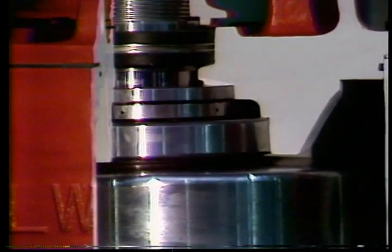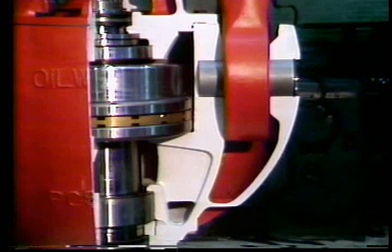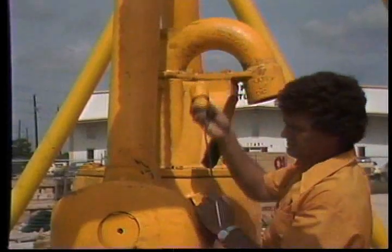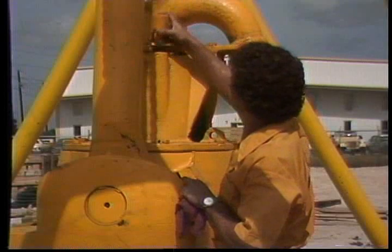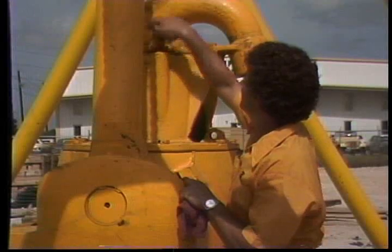The upper bearing, main bearing, and lower bearing all operate submerged in an oil bath inside the housing. Be sure when you fill the housing to use an extreme pressure type gear lubricant — Oil Well recommends AGMA spec 250.03. If you're not sure, check with your driller or mechanic. The oil level should be checked every day using the oil dipstick in the housing cap. Since the dipstick serves as a breather for the housing, be sure to put it back in before you use the swivel, and never let the swivel run with an insufficient amount of oil.